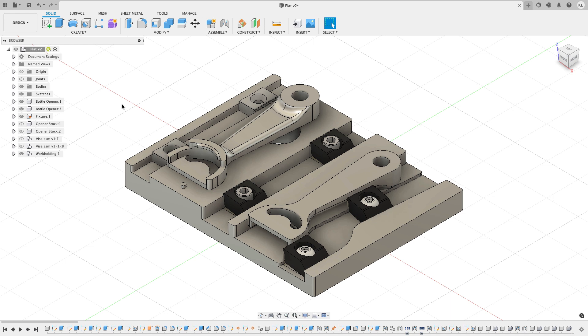I'm going to use a part I commonly use in one of my classes — a fixture plate that holds a couple of bottle openers. It's not a great use of a fixture plate, but it's small enough and machinable enough in a class period for everyone to make their own fixture plate and understand how to use Mitee-Bite clamps for a two-op operation to machine the bottle opener you see on screen.